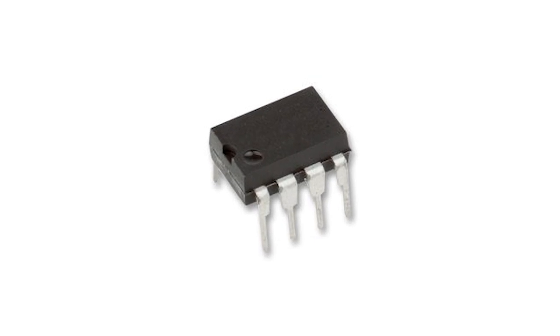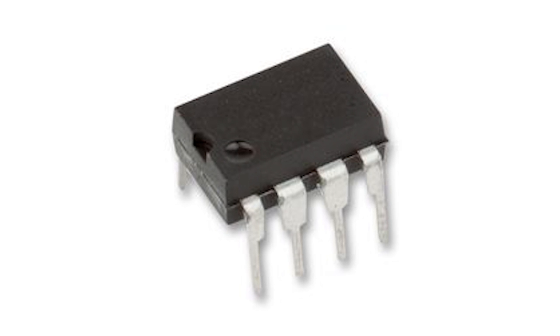This is the MyDMX Buddy. If you have a problem with your DMX, it's probably because your DMX chip went out. That little black thing right there is the DMX chip. All you have to do is place both your fingers on both ends of it and pull as hard as you can - it will pull out. Even though it looks like it's soldered, it's not. You can buy another one for about two bucks and just push it right back in to the same place. All you need to look at is the notch in the chip - when you pull the old one out, put the new chip in with the same notch pointing the same direction.